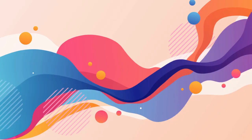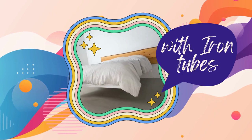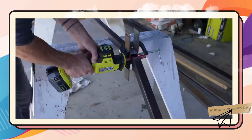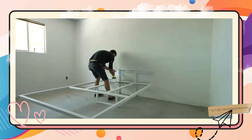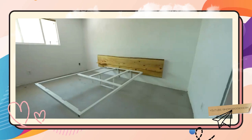Number 1: A Floating Bed Project with Iron Tubes from At Home Made Modern. Simple yet robust, beautiful, and ideal for a queen-sized mattress. Get a sturdy 1.5-inch steel square tube to ensure perimeter stability. To ease the welding process, use magnetic clamps, and use spray paint to skip priming before installing the steel tubes. The hidden legs create a floating illusion, while cantilevers add support. Attach it securely to the wall with a quarter-inch flat bar for a sleek, flush look. This DIY masterpiece features plywood slats and a live-edge cedar headboard. Check the full video for the kiln-drying wood method crucial to the project.